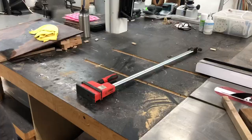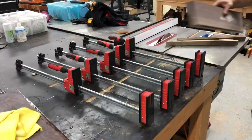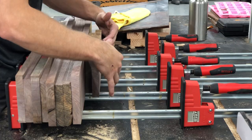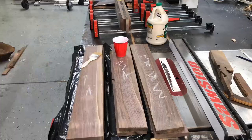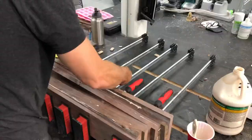Since I'm cutting these inch-and-a-half thick pieces down to about three-quarters of an inch, and I want my table legs to finish at inch and a half, I'm having to glue them to other walnut stock pieces. Once I get them glued together, I am essentially taking that three-quarter inch piece I just cut, gluing it to another three-quarter inch piece, and then I will match that mirror image bookmatch after the glue-up.